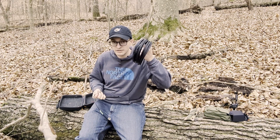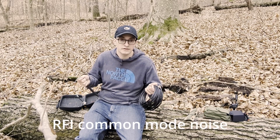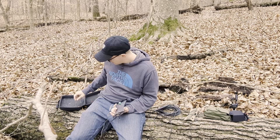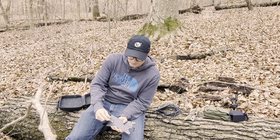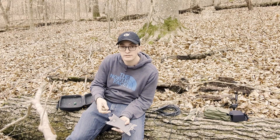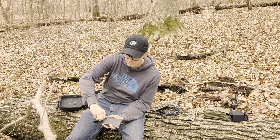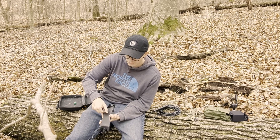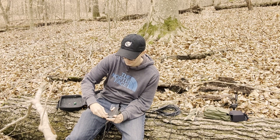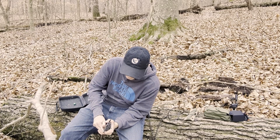Because we have the RF chokes here on the end, I think that'll help if we put this near the transceiver instead. That way the vertical transmission line won't pick up a lot of vertically polarized interference. So we're going to connect the other end in this case to the antenna. With these antennas, I do not like the connector being just straight out if it's meant to be hoisted up. I do recommend if you get this antenna, get an L-connector — we'll talk about some of the pros and cons, but the L-connector will definitely help with relieving some strain on your setup.